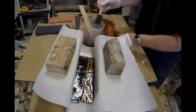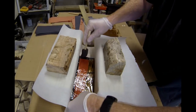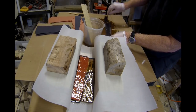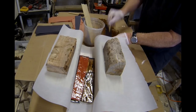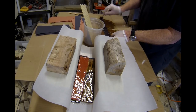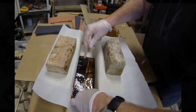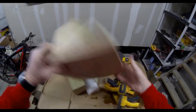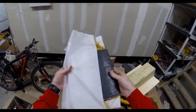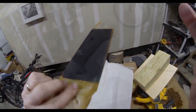Now I moved on to that hybrid handle. I covered the whole hybrid micarta, wood and micarta handle or scales on a separate video. I'm using a spalted maple on half of the knife scales, and a combination of black and brown construction paper. These are all laminated with fiberglass resin and then pressed together in my micarta press to form this hybrid material. The end result is wood showing on the top of the scales, and a micarta that when you grind through it will have both black and brown lines on the bottom of each scale. This is the material when it comes out of the press — you have to sand off some of that black construction paper to see the wood.